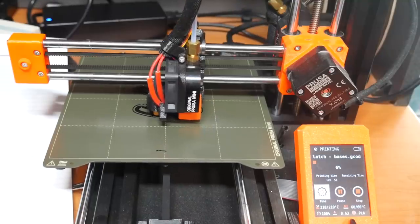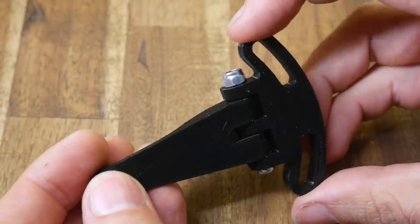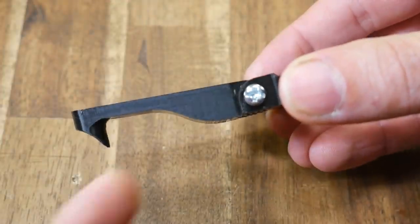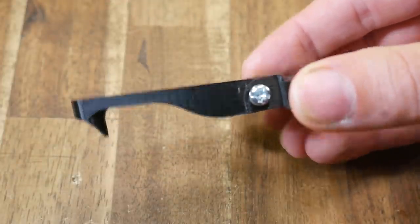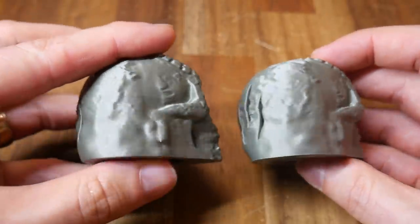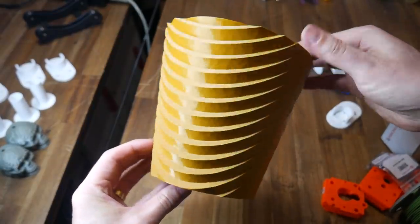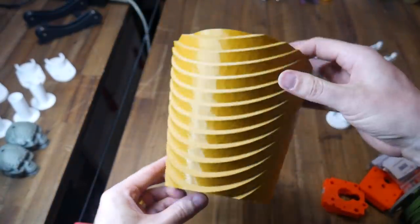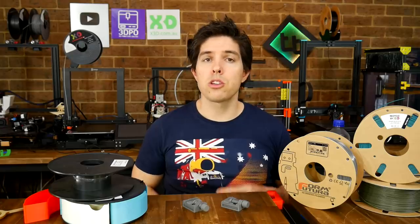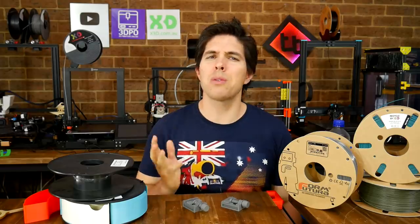When switching to this recycled PLA filament, I didn't have to do a single thing differently. All print settings in the slicer remained the same, the parts adhered as you would hope, and as far as I can tell are identical in strength as well as quality. The majority of my printing has been done with recycled filament, and no one in the comments has been pointing to my print quality going downhill, which speaks to the viability of making the switch to recycled. But usually thermoplastics degrade just a little each time they're remelted and recycled — so how is this possible?